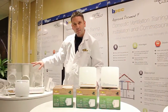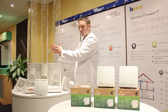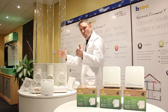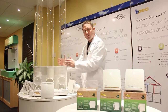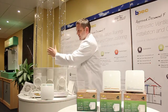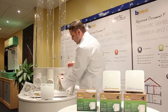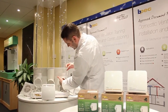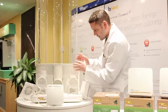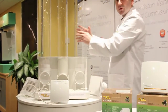Here we've got the Environment Air Power test meter. These clear tubes replicate the resistance in a typical fan installation — on a wall sleeve and grill you're going to get a bit of resistance, usually 10, 15, maybe 20 pascals. The resistance in these tubes is around about 15 pascals, and inside the tubes we've got a clear plastic disc. As we apply air into the tubes, if the fan can overcome the resistance it's going to push these discs up to the top.